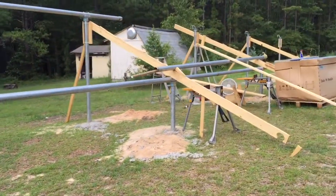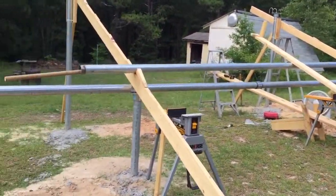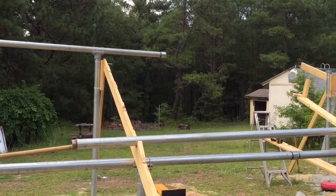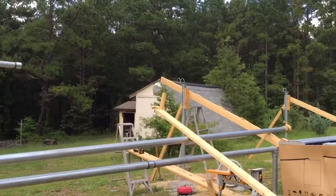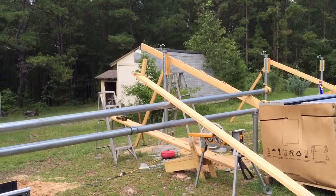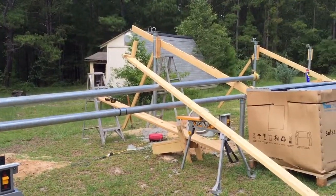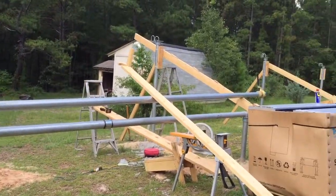Here you can see I've rolled this one up — actually picked this one up to the spot where I want to begin. I've got a unique situation here because of the long pipe up there and the distance between the coupling and the far right-hand resting pier. I'm actually only going to have one pier that this pipe is going to go on, so what I've got to do is stage it here and slide it over to the right.